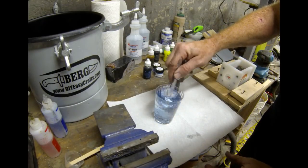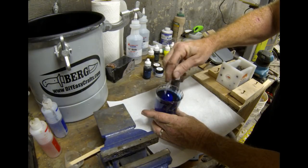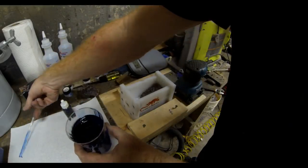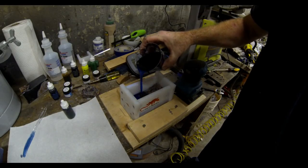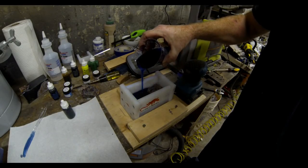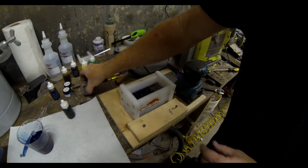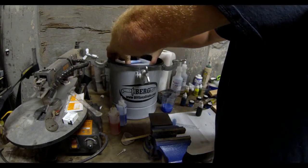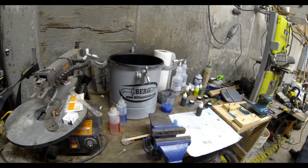For this one, I added a drop of blue dye — it really makes a nice translucent blue. I'm going to run through the exact same process: mix it adequately, add some stabilized wood burl, also from Russian Wood Hunter on Etsy.com. I'm very happy with his products. Put it on the vibration table, vibrated it for a minute to a minute and a half, and then right into the pressure pot again.